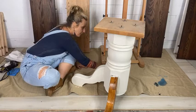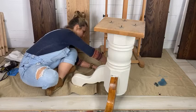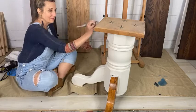So what I've decided to do is I'm putting down drop cloth chalk paint first as sort of like my primer, but it's also blocking my color. It's giving me a great base. And then I have this almost identical color in the silk line called Endless Shores that has a really beautiful sheen that it dries to. And that's going to be my second coat. And then I'll be done. I'm done. And I did it on Dixie Belle Live, and it looks beautiful.